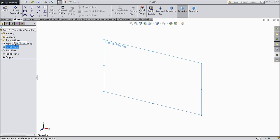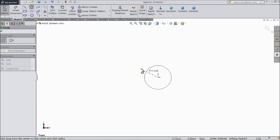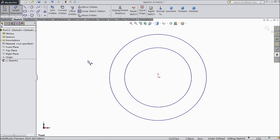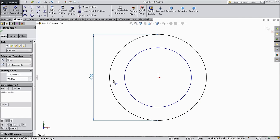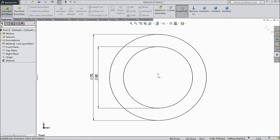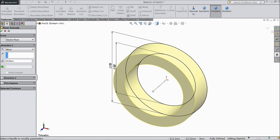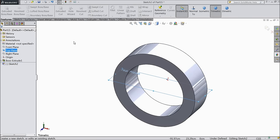Choose front plane, sketch, select circle, and draw two circles with origin point, and keep the diameter 70 centimeter and 50 centimeter. Okay, and let extrude it, and extrude up to 20 centimeter. Okay, select top plane, sketch,